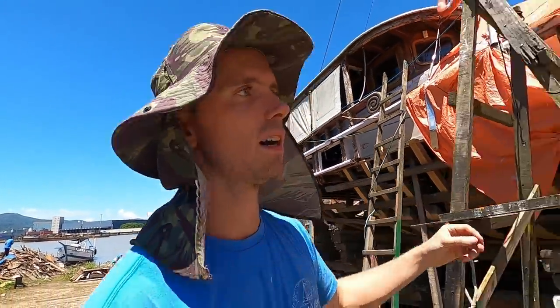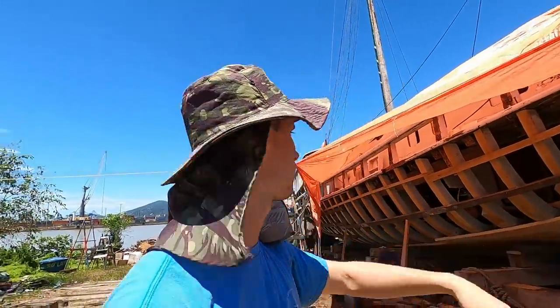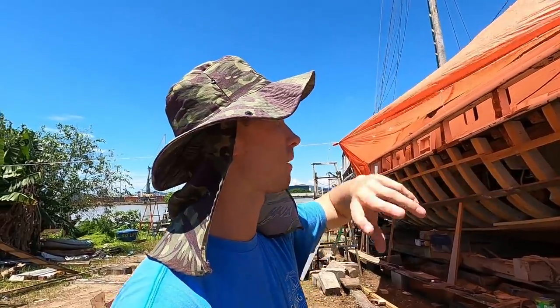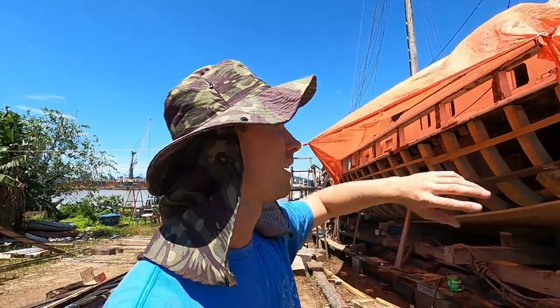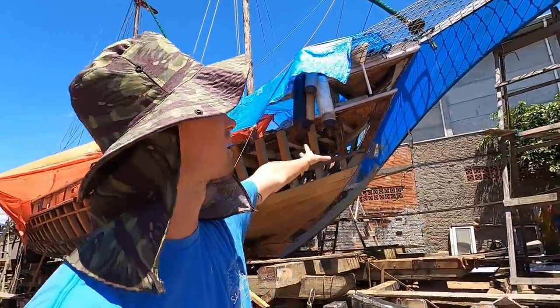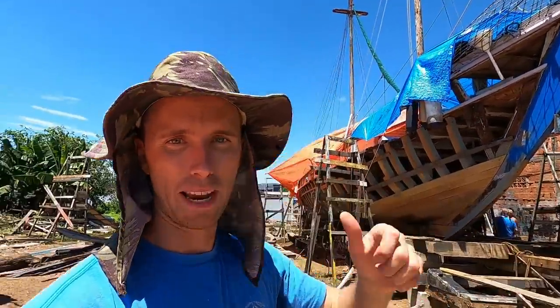So yes, not a single piece of planking is kept on the boat, let alone frames, because we're doing this once and from now on we only want to maintain the boat. And as we were doing most of the frames and most of the planks anyway, everything got removed and we're starting from scratch. We're keeping some of the floor timbers and we're keeping the keelson, but most of it, and the stem, this is the roda de proa in Portuguese, big nose of the boat. We're keeping that, but the rest of the hull is going to be new wood, more durable wood, garapeira,